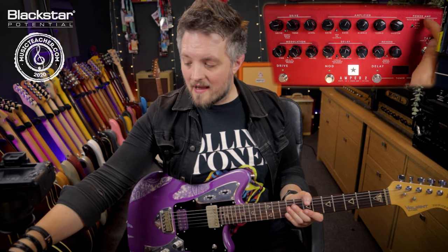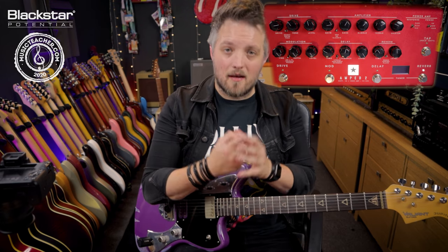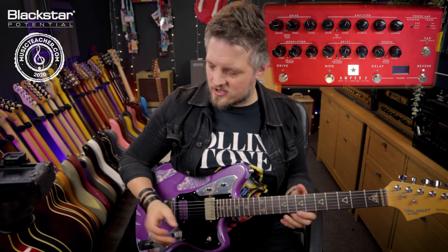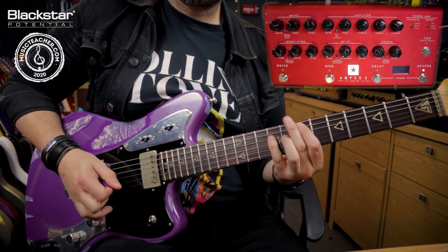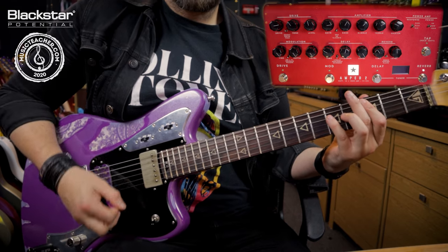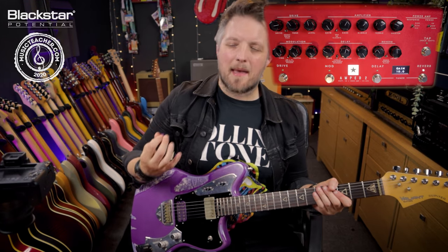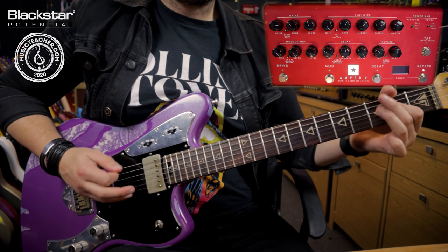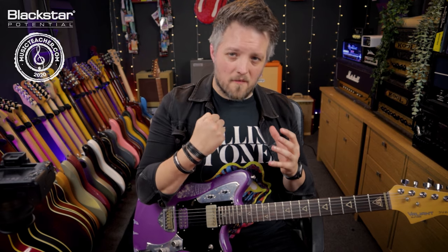What you're going to hear now is a cleaner, tighter tone. While the EL84 and EL34 British style sounds are a little bit more saggy and compressed with a vintage feeling, the 6L6 is tighter and more responsive. It's great for heavier music or more precise music where you really want your cleans or drive sounds to hit without any of that compression. It's great for metal and rock where you just want the chords to really ring. With 6L6 we can really crank the gain and it doesn't get muddy in the low end.